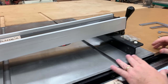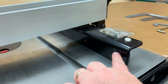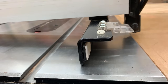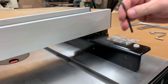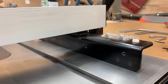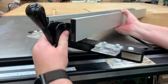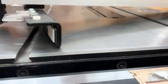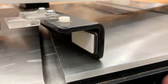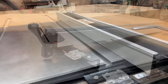Mine was right on, but if it weren't, there's an adjustment on the fence — all fences are slightly different, but I'll show you how it works on mine. There's a little set screw that takes an allen key, and that drives a little wedge in and out. That would push the left side out, shifting the fence to the right at the back. On the opposite side there's the exact same setup — another allen key screw driving a wedge on that side. By manipulating these two wedges, you bring the fence into perfect alignment.